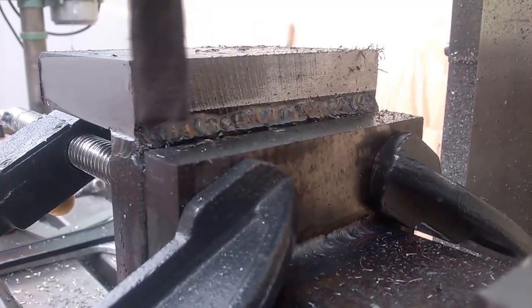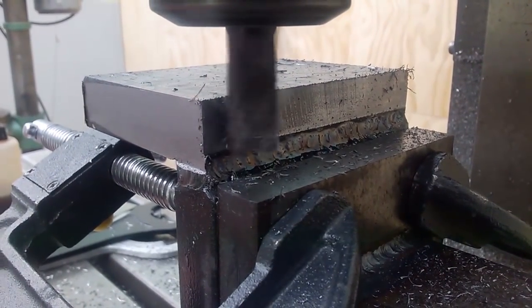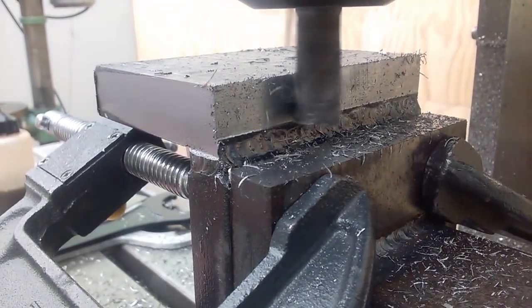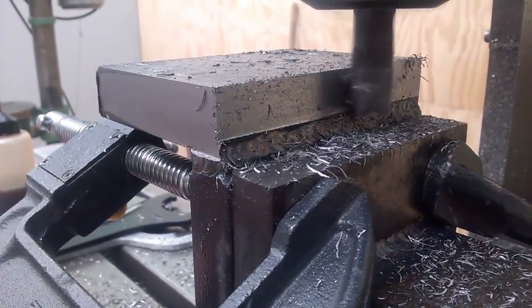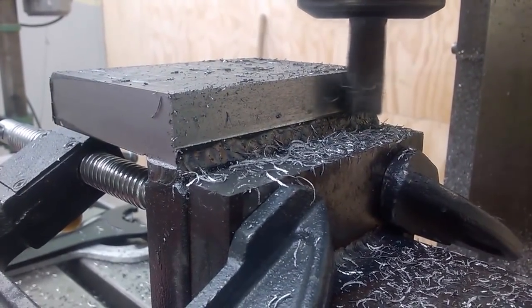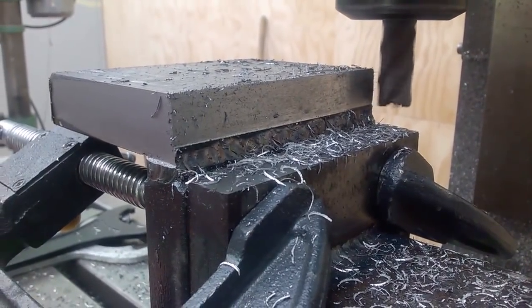Just showing a few more clips, and after finishing the part I was very happy because I got it to within maybe a hundredth or two over the entire distance, which was 150 millimeters of the L-bracket. I was very happy with the setup cube, which made everything much much easier and also made it repeatable because I had to make more than one.